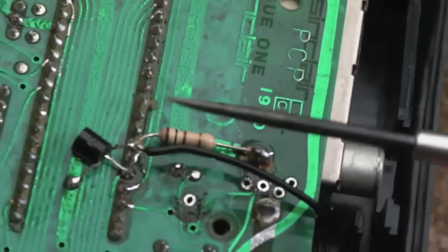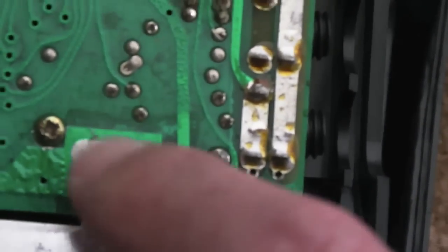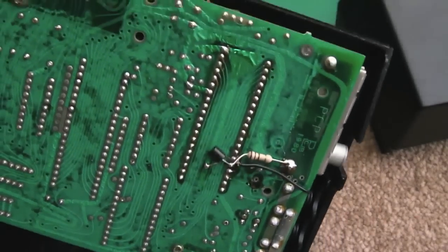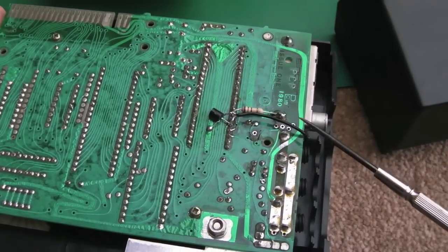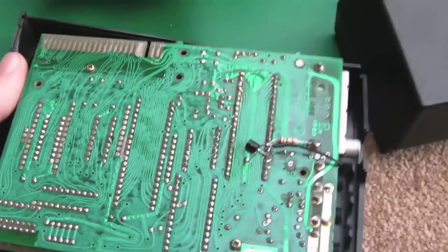The idea is to encapsulate some of these with heat shrink tubing. It's okay underneath there because the nut stands the thing off the bottom of the case anyway. It looks a bit of a mess - a bit of a dead bug squished mess - but I will isolate this part here just so there's no chance of it shorting onto anything else, and perhaps shorten the length of this wire. I do need to do another revision to this now anyway, because on this issue one ZX81 the brightness is very very low.